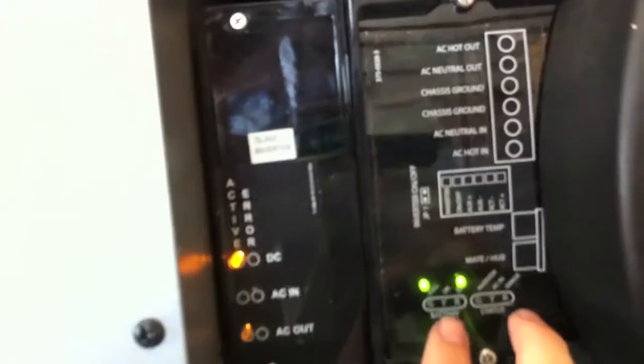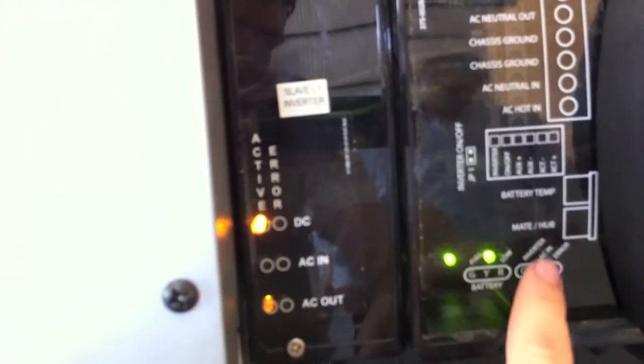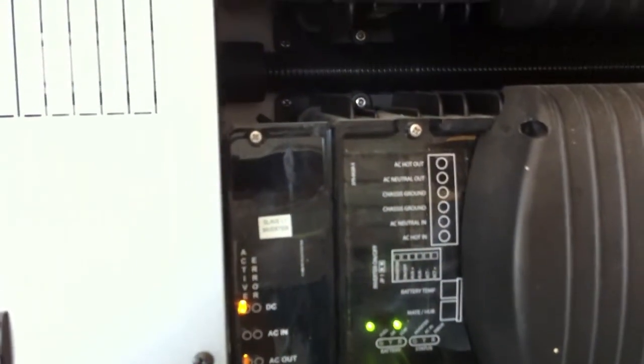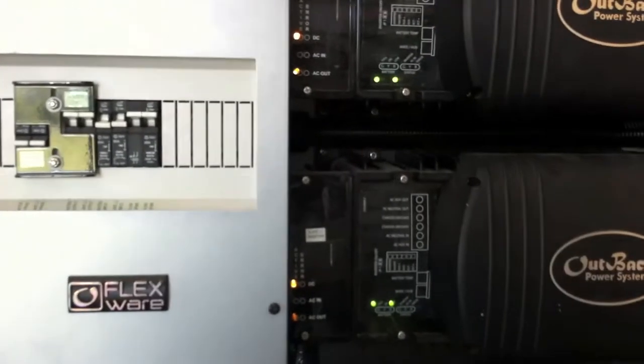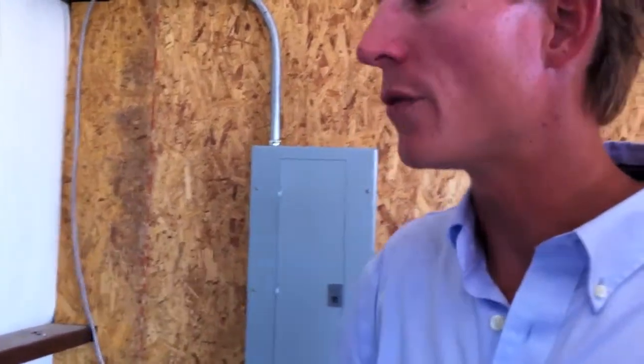These have been green, except for one time at night we had a drop to yellow. What that is — this is a slave to this one. If your load is real light, it'll shut this one off. Because there's a transformer in each inverter, even though it's receiving one leg, it'll hit the transformer and have 240 out. So let's say no sun, running full battery all the time — how long? Three days is what I built for autonomy. Three days — in the wintertime, December's the worst month, so three days no sun. You can do even more than that, but it's a 50% depth of discharge. If you really needed it, you can program your Mate and it'll let you go lower than 50% — it's just not advisable. But once we have the generator, it won't matter.